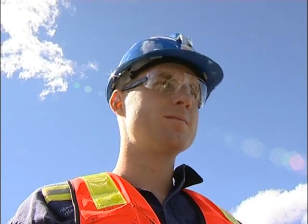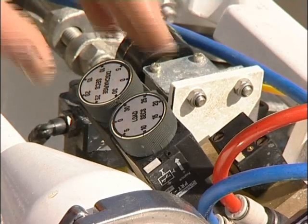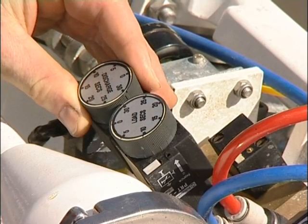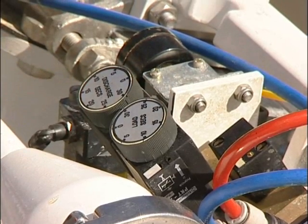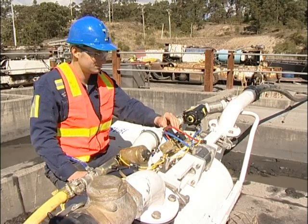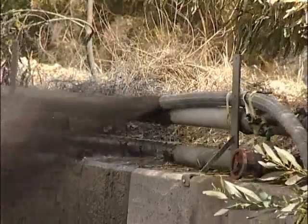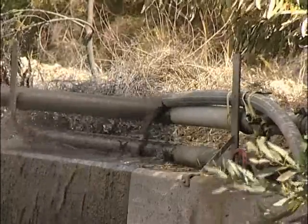Once pumping has commenced, observe the operation for several cycles. If necessary, adjust each timer as shown until you are satisfied with the throughput. The SV60 manual has a guide to correct setting of the timers. The unit will now continue to transfer at the set rate as long as material is available.